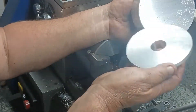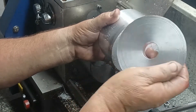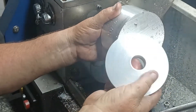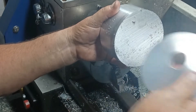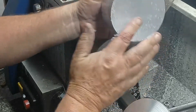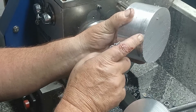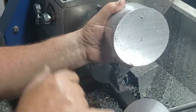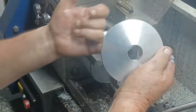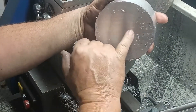Alright, this is the other section. I actually cut this one off here — so this was the main piece, it was one big piece. I've turned this one now. This one I've got to turn to exactly the same shape. So once I've got this shape — this side is already done — I've got to do a face cut here, get this square, and then over here I've got to get this size all the way down. It's going to slide and go inside here. And the motor axle has got to be on this one also.